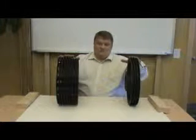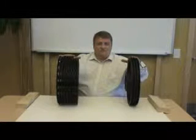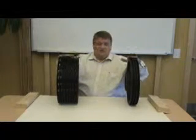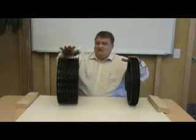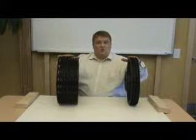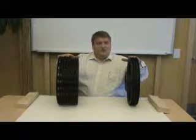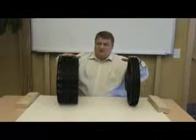This one is good for about 75 horsepower drives, whereas this one will handle in excess of 200 horsepower. The mass by itself — we solved that problem by reducing it. It's a very lightweight design, and it is also made out of nodular cast iron, so it will sustain the high tip speeds as well as larger diameters, which is the other point.